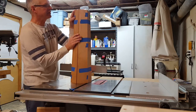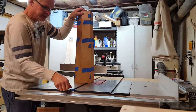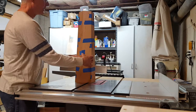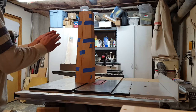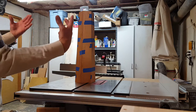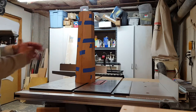That looks great, everything lines up just nicely. That top angle, that last angle looks great. Going to take a piece of tape and wrap it right there — that'll all come together once it gets clamped. The next step is to lay it out flat the other way so that the glue joints are up, put glue down each one of the joints, roll it up, and then clamp it around the top, middle, and bottom to hold it together while it dries.